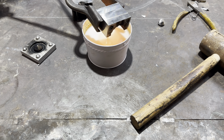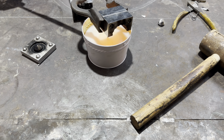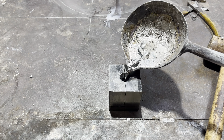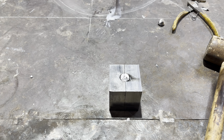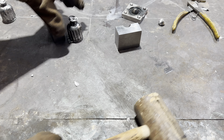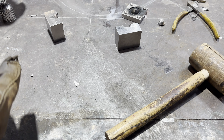I did have to re-smoke the molds after every projectile since it wasn't really black on the inside anymore. Then I remembered I'm working in a blacksmith shop and I can just grab some tongs rather than holding a hot lead mold with gloved hands. Here's our fully sooted and reassembled mold - let's pour one more Foster slug so I can show you guys how they look, then we'll clean them up and get them ready to fire out of the cannon. With a little bit of gentle persuasion, the first side broke free pretty easy, a couple of gentle taps on the back, and there's our projectile. They look a whole lot nicer, nothing gets marred up, and all the rifling is still intact. Now let's remove the sprue and see how much they weigh.